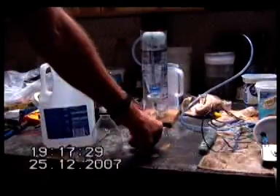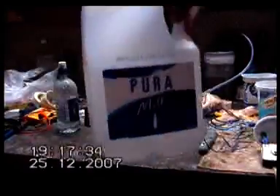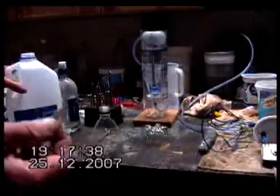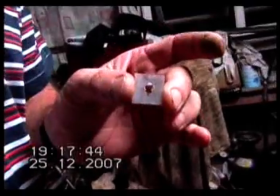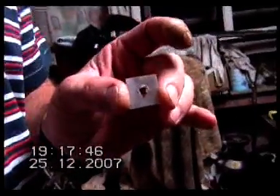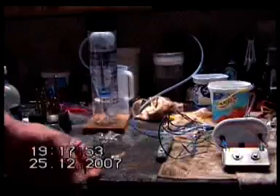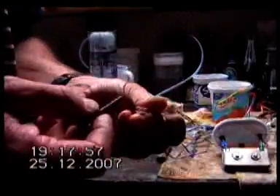The other thing I've come up with is insulators between my plates. I've got a 3 litre milk bottle, and the plastic in this is reasonably thick, so I've cut these into a grid, marked them into a grid of about 20mm square, and I've put a hole through the centre to match my insulated bolts, and then I'll put those between my plates. To get my insulated bolts, I didn't have any plastic bolts, and of course the shops were shut, as they always are when you need something.